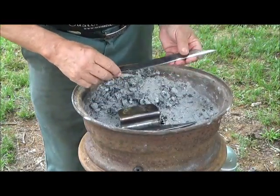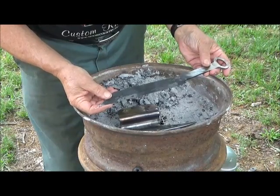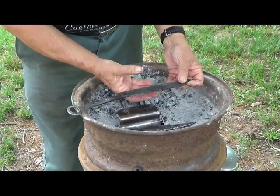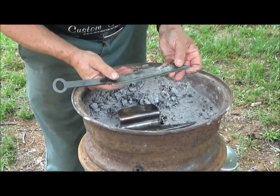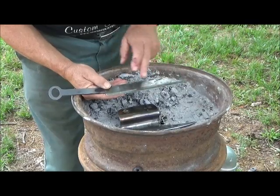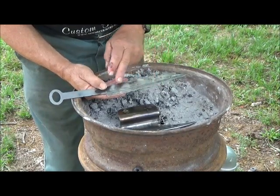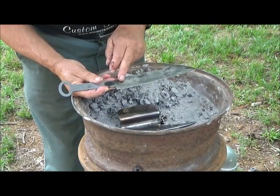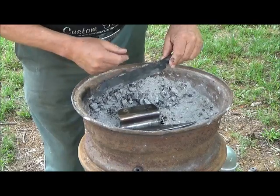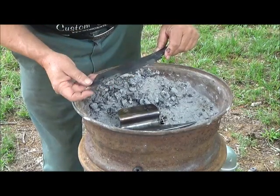Now, on our blades — once they were tempered, they looked like this after I quenched them in hot oil. This blade had actually sagged a little bit as it sat over the fire, and most of the heat was coming right here. That is reflected when I polished it, because there are actually burn marks in the steel right here on the surface, right here on the edge of the blade. The blade was successfully hardened, but it did pit here, and you can also see the strange grain structure showing up right here. So this side is polished, and this is what it looks like unpolished. This blade is now going to have to be reground and smoothed again to remove this excess material.